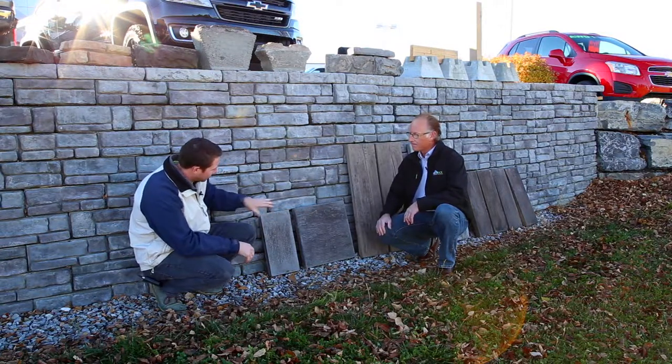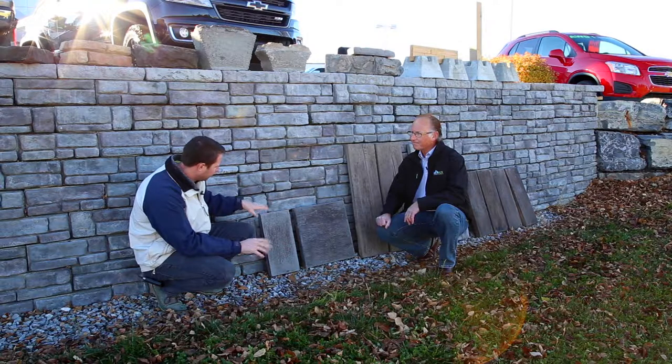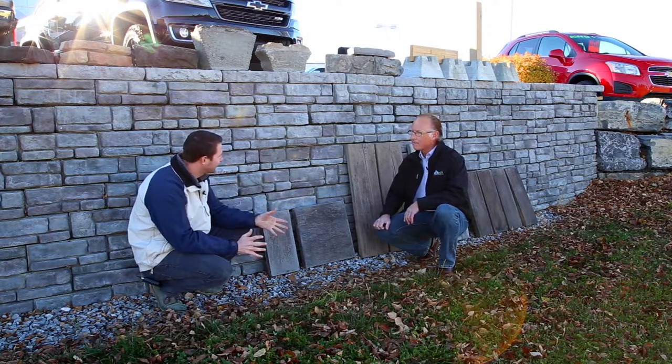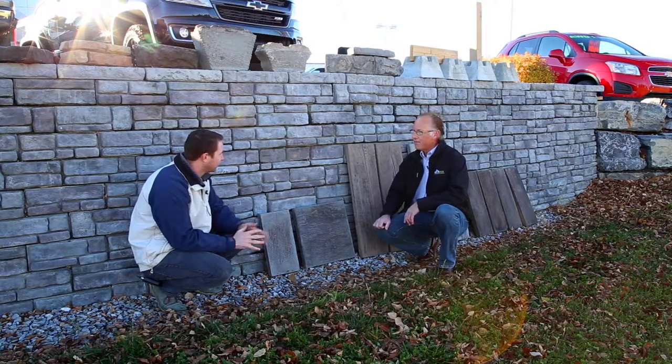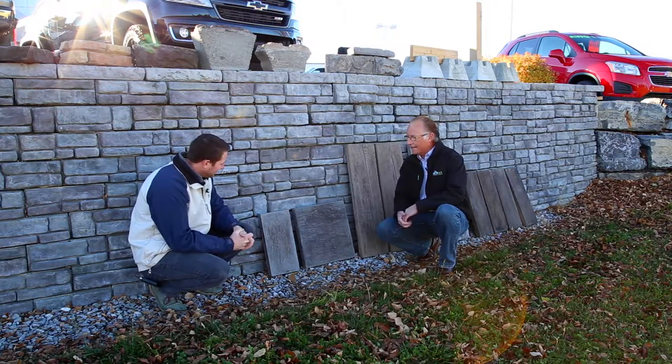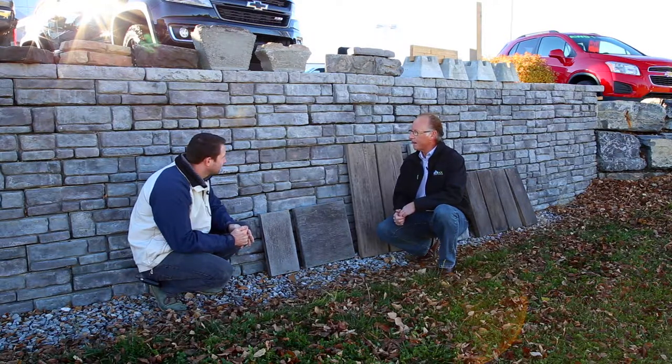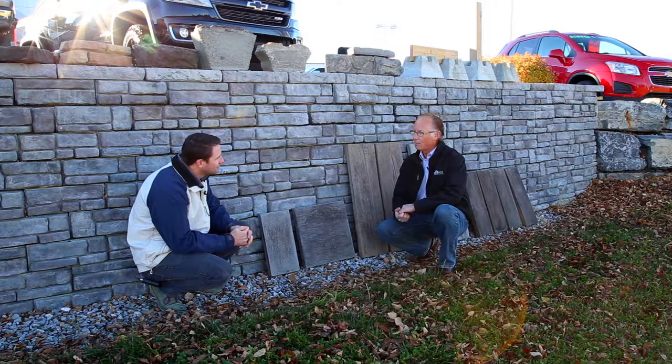Alan, one question about the products that we've been faced with. The natural color that's in them, do you find it fades a lot, or how does it weather? That's a good question. Similar to any wet cast product, initially before it's fully cured, it'll be quite bright. In time, it could fade a little, so you could expect some fading. To reduce that, we always recommend to seal our products with a concrete sealer.